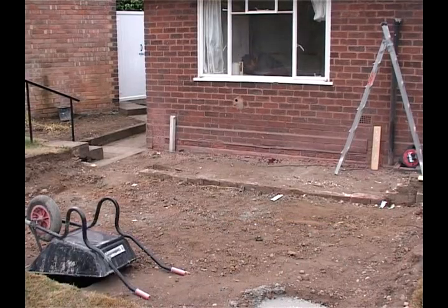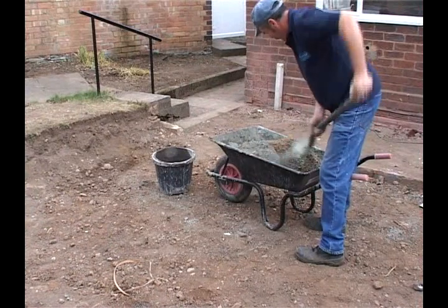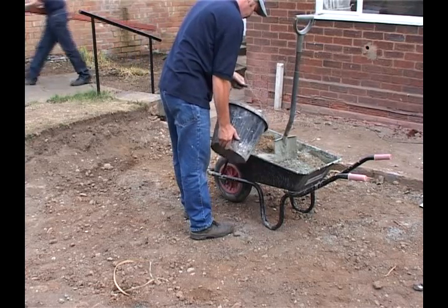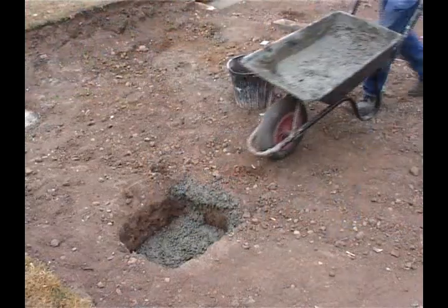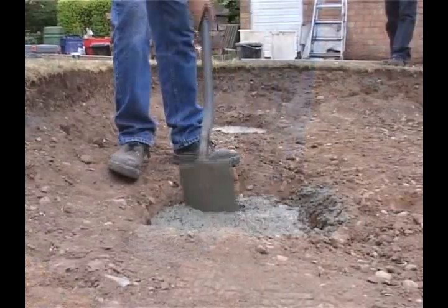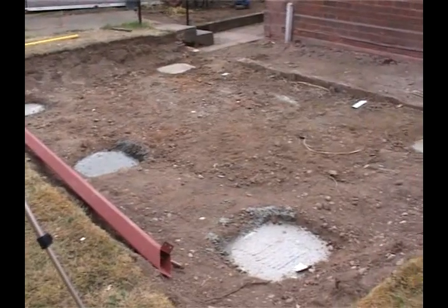One of the key distinctives of the DuraBase is the fact that you don't need to lay a complete concrete foundation. However, you do have to install what we call concrete pads. The position of the pads and all the supporting information you need will be given to you well ahead of the arrival of the DuraBase kit. This will allow you to prepare the site ahead of time. The depth and the size of the hole is specified in your instructions. This particular installation needs only 5 pads.